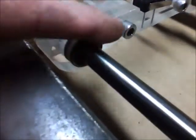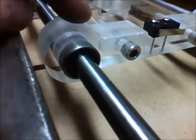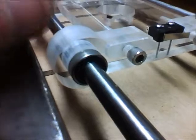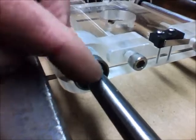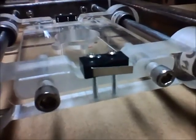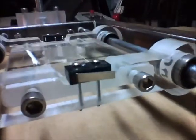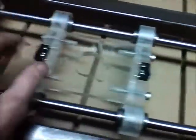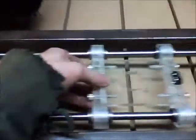These came out perfect. This is a perfect press fit — the hole turned out to be literally a thousandth of an inch smaller than the bearing, which was absolutely ideal. There are bolts, a little recess, and you can see the two 2-56 screws going through right there. And for the stop switches — this is the extruder, obviously — it's just smooth as can be.